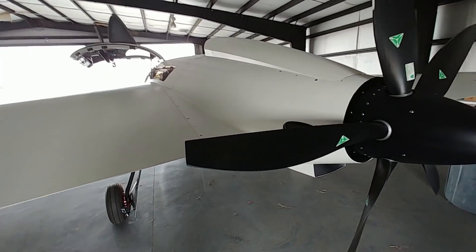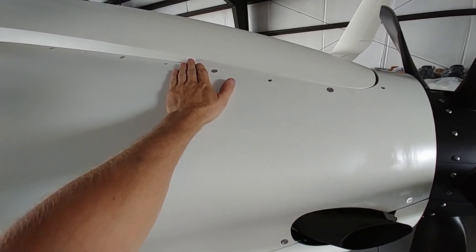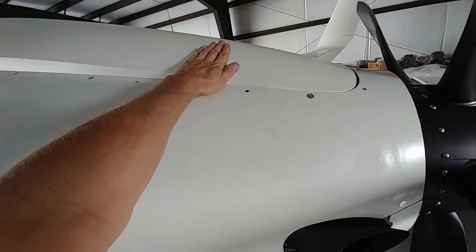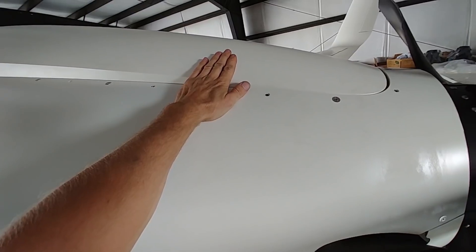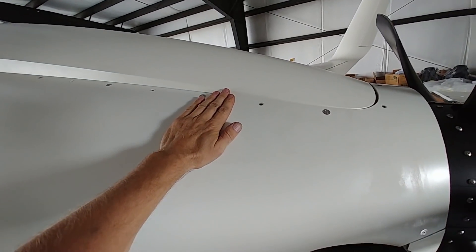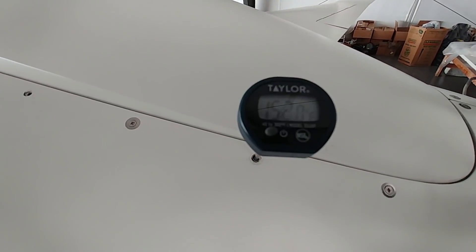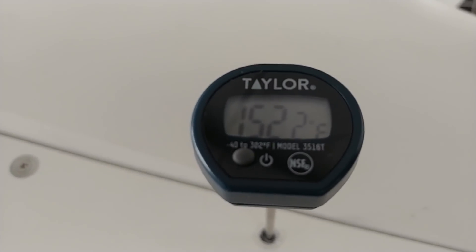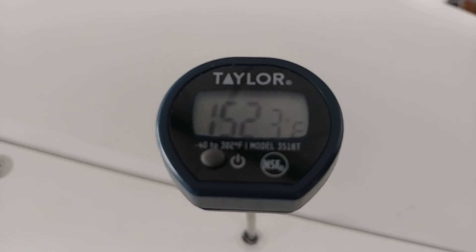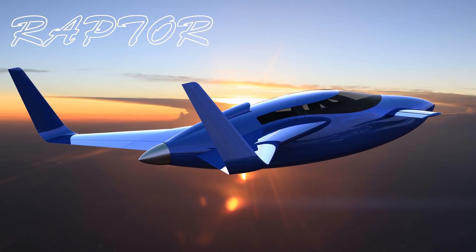Since that was recorded, I got a little more information about some injector parameters that we might be able to change, or possibly change out injectors — I'll let you know how that goes in the next update. Here I'm just checking what sort of heat is coming in the cowling above where the exhaust comes out of the second turbo. It wasn't bad — I got 152 degrees Fahrenheit, which is certainly not going to cause any problems with the cowling. The heat shielding is working well. That's the update for the first half of this week. I'll let you know how things turn out with the tuning on Saturday. Thanks for watching.